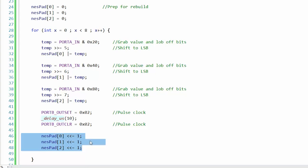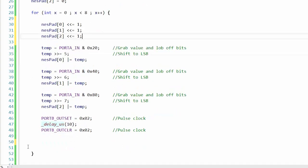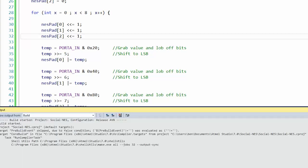See how I bit shifted one to the left after the sequence? Well, by doing that, I bit shift the LSB one to the left, and I bit shift the MSB off into oblivion. So the solution is to do that first. So the first time this loop runs, it's all zero, so who cares? But then after it does its last OR, the LSB will stay where it is because it won't go back and do this one more time. Oh, sorry. Rookie mistake. I should have known better.